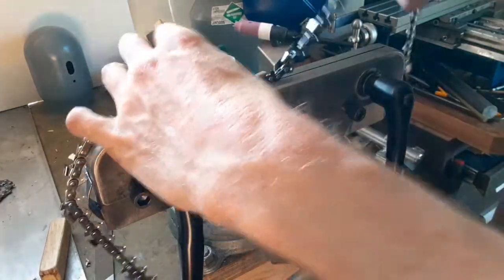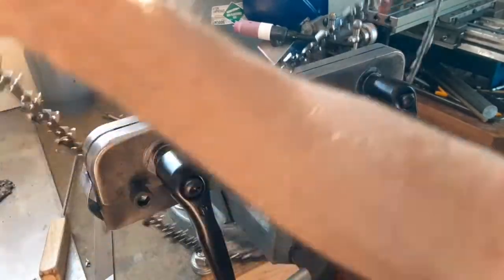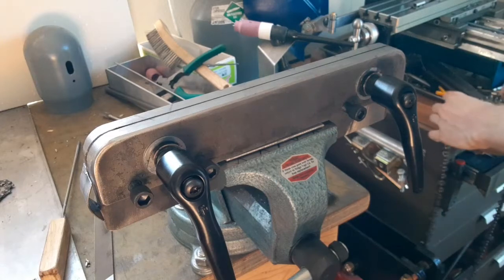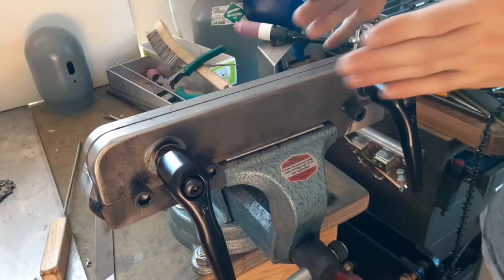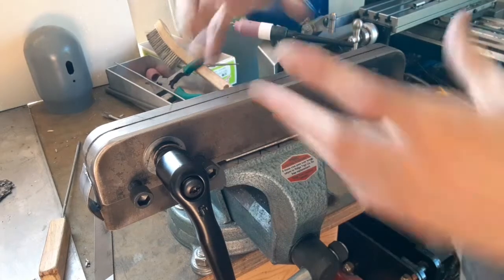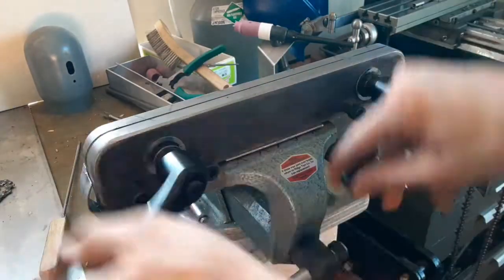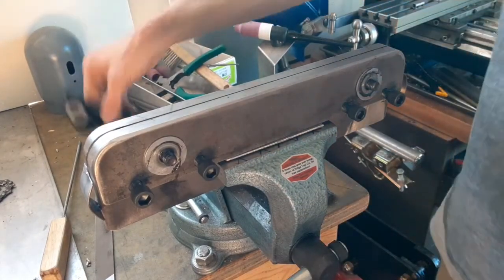The plates had a little bit of bow in them from being sheared. So they're kind of preloaded like this, and when you clamp together, the center will clamp first, and it should compensate for the length of the bar. Clean that up a little bit.